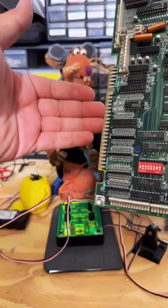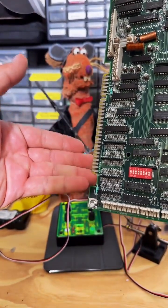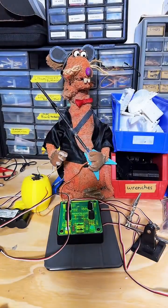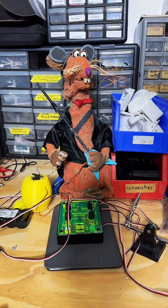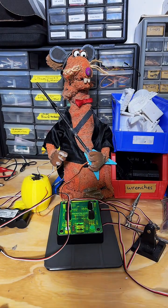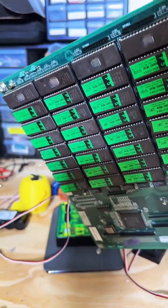You put what's called an edge connector on here. This particular connection here is called JAMMA. JAMMA is an arcade standard. If you saw that Tempest a minute ago that was sitting to the side of that Marvel vs. Capcom, that Tempest is called dedicated. This JAMMA is a universal format. So JAMMA allows these boards to swap. They use ROMs. So these are ROMs, right? You have ROMs on there.